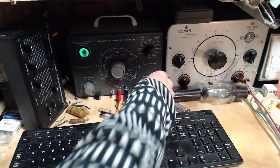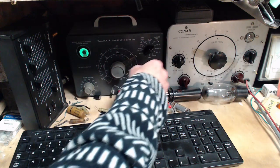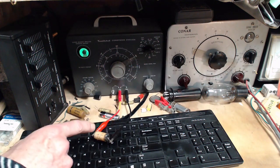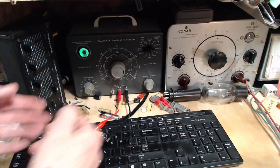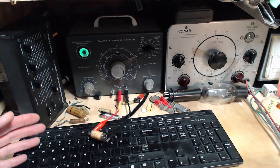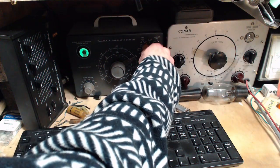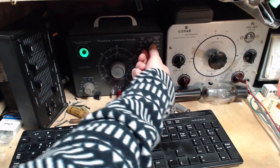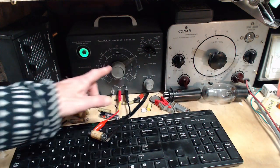You know what? This is behaving as if it's open circuited. That there's no capacitance in it. 250. Yeah. This is behaving as if there's no capacity. So let's measure it, because it's also showing zero leak, which, how can that possibly be? This is behaving like a brand new capacitor, but one with very little capacity. So 0.22 is going to be in this range here. So now I'm going to turn the control.